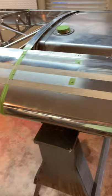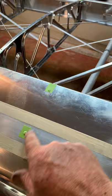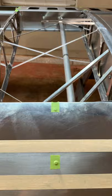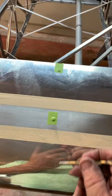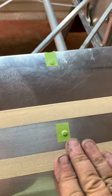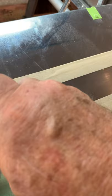Remember, this is going to be under the fabric - we're going to be covering these with fabric and later with tapes. What I like to do is take a drill bit and go over each rivet head to make sure there's no bubble or wrinkle in these tapes - I make the rivet heads perfect so we can seal them later. It is so humid today that the polytac is just turning white when you put it down.